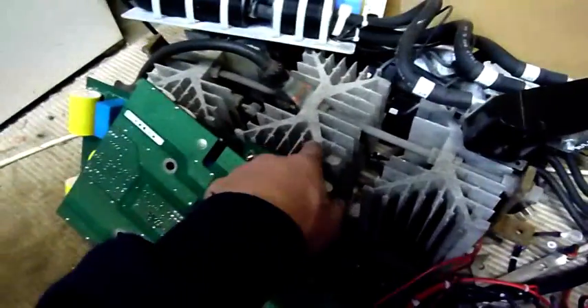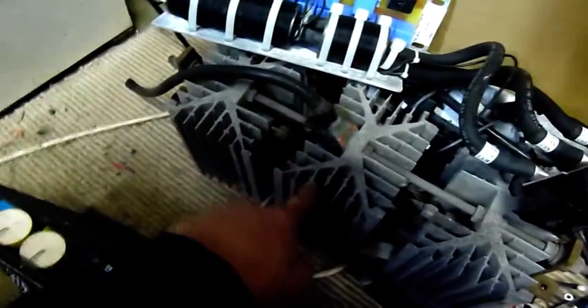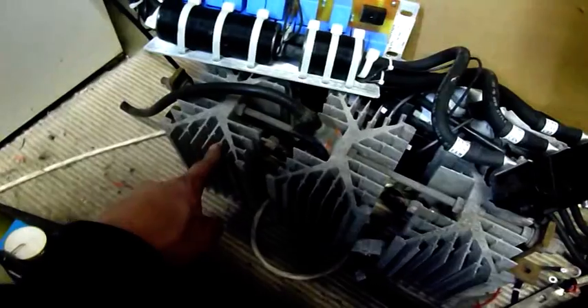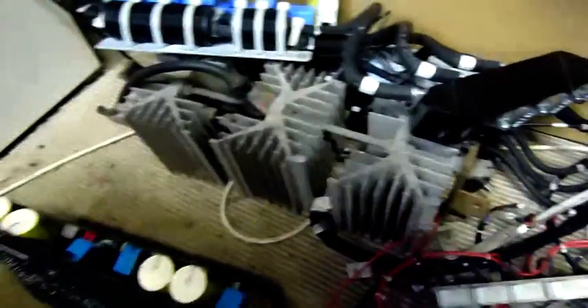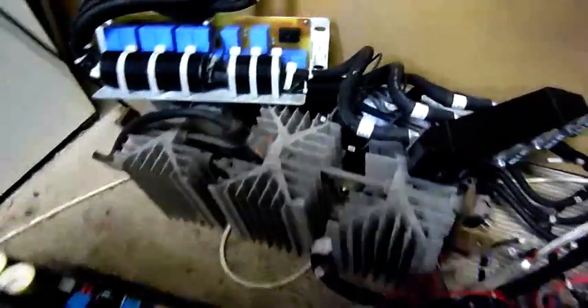That's actually out of an industrial forklift battery charger. It's a full wave three phase rectifier. It's got three leads leading in, but I always thought you only needed two diodes for full wave on a center tapped three phase transformer. There's a third one there which must just be for blocking reasons. They're not much use unless I want to build a single or half wave single phase rectifier, and they're just way too big.